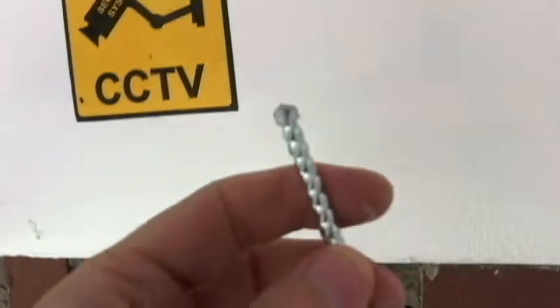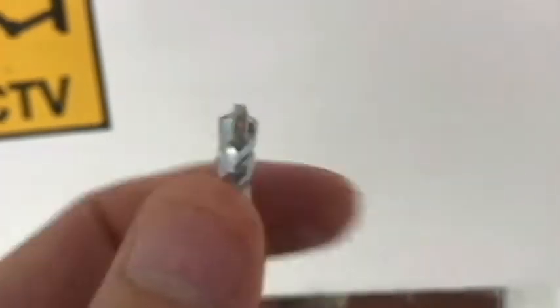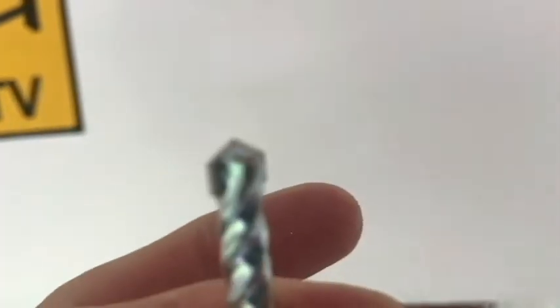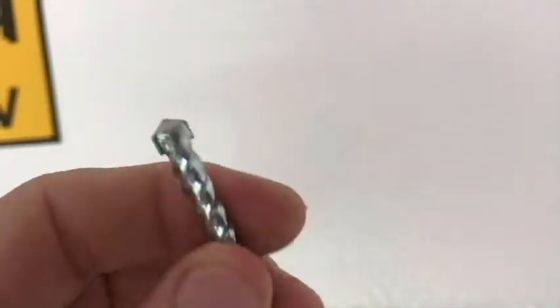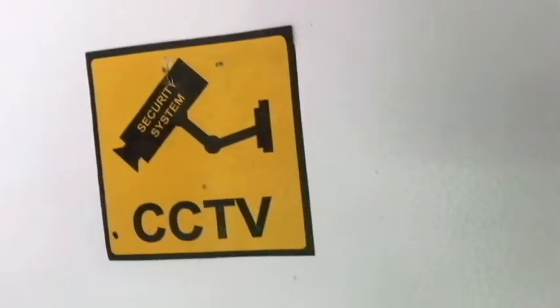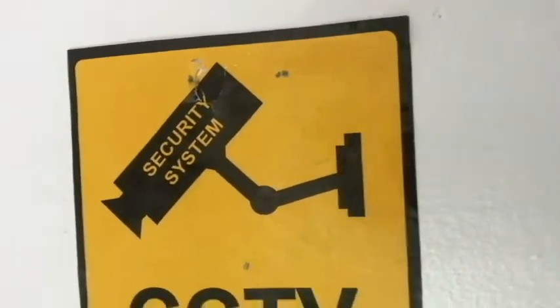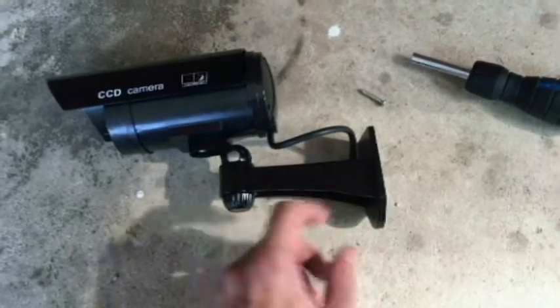Here's what a mortar bit looks like if you're going to drill in mortar — it's not sharp at all, it's flared in to start out the hole. This is a quarter inch, which is what I was going to use, but I'm not going to use the anchors anymore. So all I'm going to do is take my small wood drill bit and just get the screw started with my pattern, then screw straight in without using the anchors. I found it easier to put the mount up by itself and then put the camera on the mount.